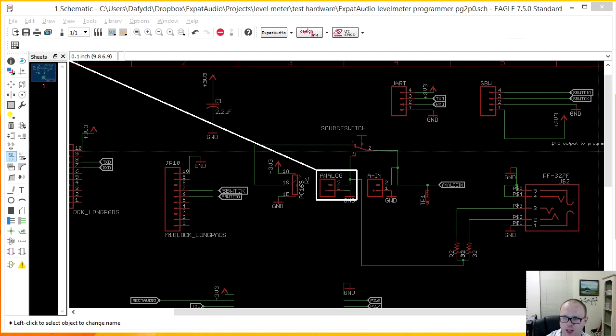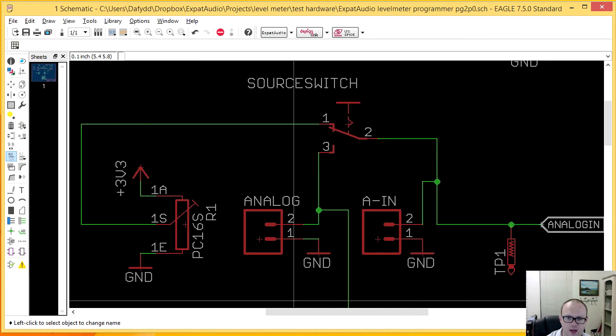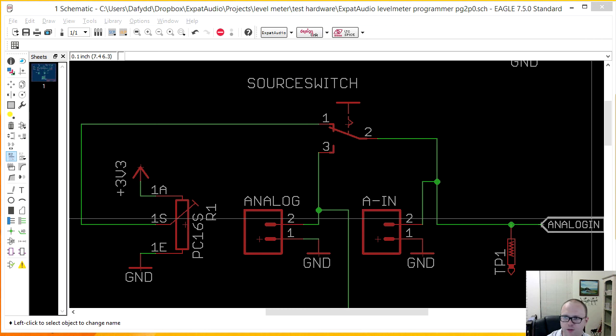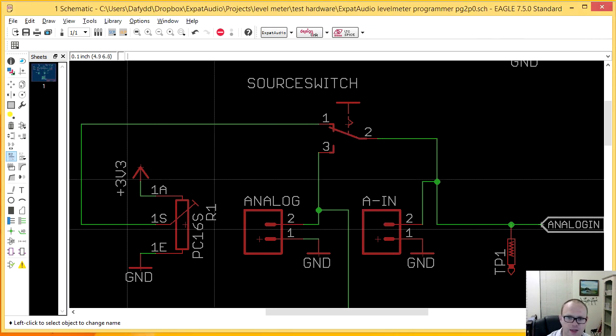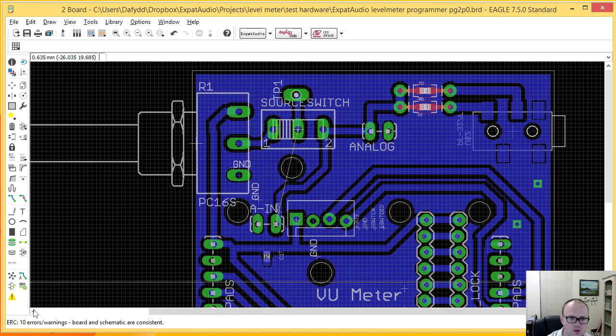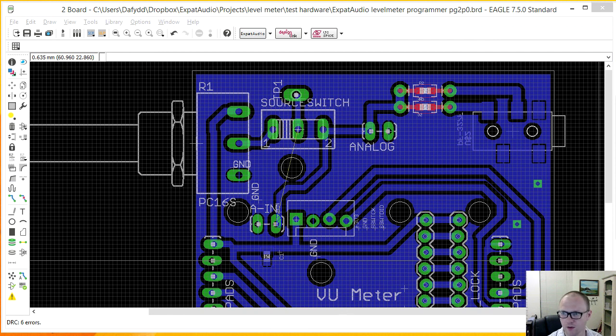But what it's not complaining about, and I was expecting it to, is that in my board layout, come on, tell me that. Okay, let's try the DRC then. Should tell me that this trace is now connected to the wrong thing. So if I do a design rule check, and let's just check it with default settings. Check. All right, here we go.